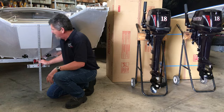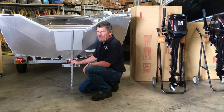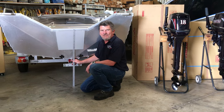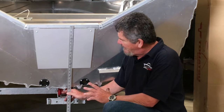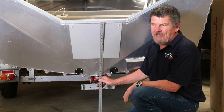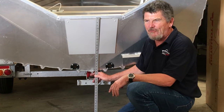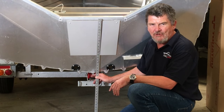The leg lengths for short shaft and long shaft outboards are: short shaft is 380 millimetres, long shaft is 500 millimetres. We do often sell what we call an ultra long, which is usually on bigger craft — normally around 110 to 115 horsepower onwards — and those are 635 millimetres.